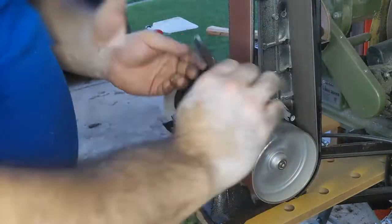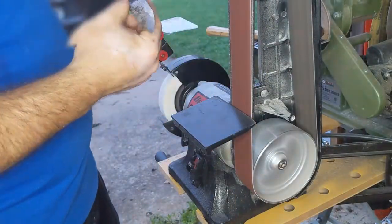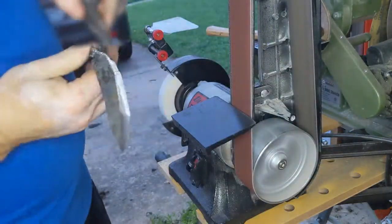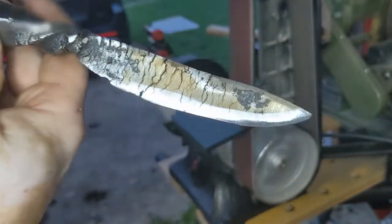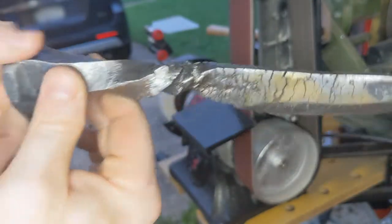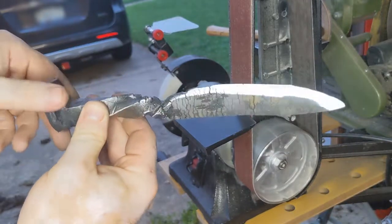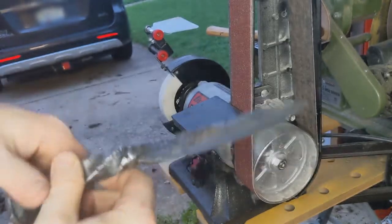to ensure you don't spoil your heat treat. Later on, I was practicing on just a bar of mild steel I used to put my anvil down, and I burned up the tip two or three times just by producing too much heat. You can see there's a little yellow in the blade there. That's a little bit of the heat changing it to a straw temperature. So that's actually a good tempering temperature, but you don't want to do that and grind. So I should have been dipping it more often. But I think it cleaned up pretty good. The bevel looked pretty good.